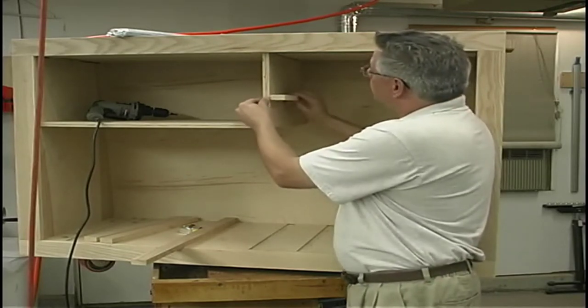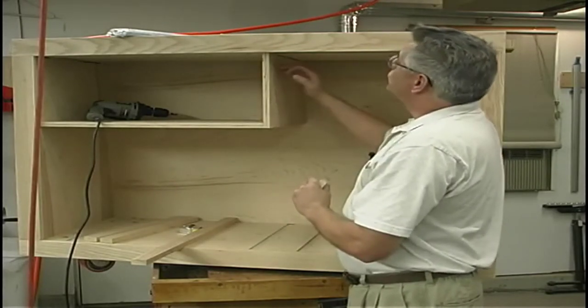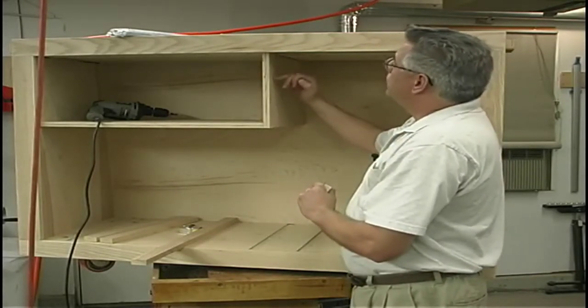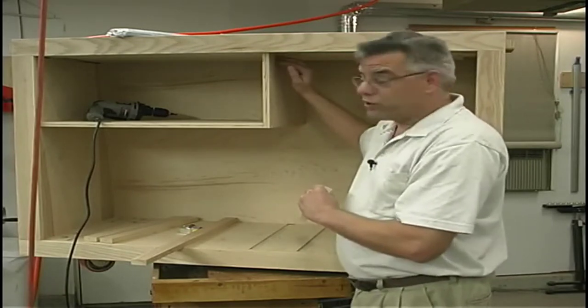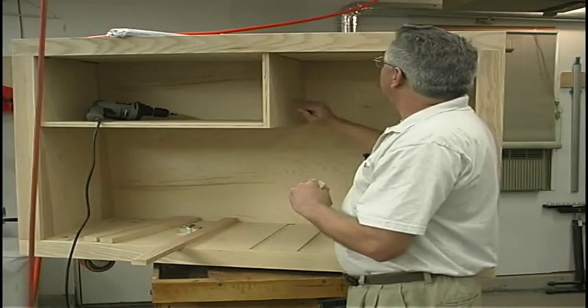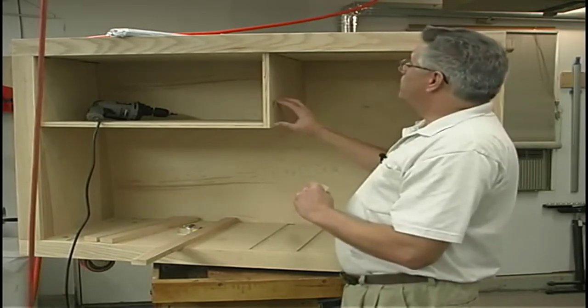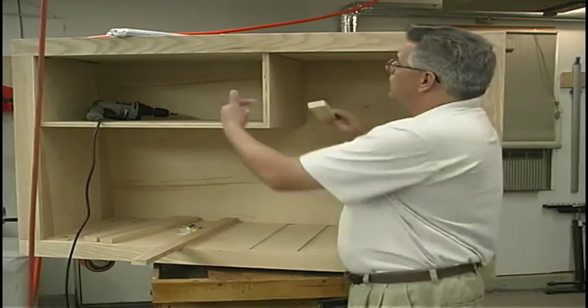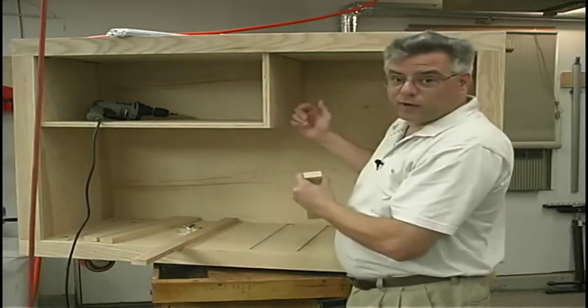Now they'll get mounted in this location, and I've made my layout marks, and that was just a matter of subtracting 3/8 of an inch from each of the center line positions for where we need those drawers to go. I also took the time to drill the holes for the mounting screws. It was easier to lay them out on this side, drill through, even though we're going to be mounting our screw from this side. It was just easy to get it laid out at this point.